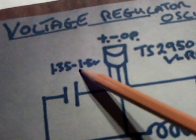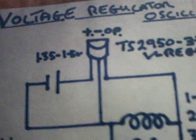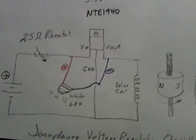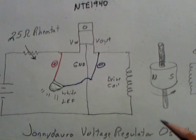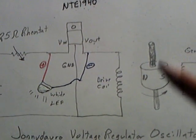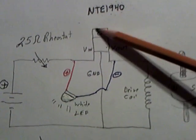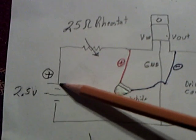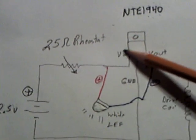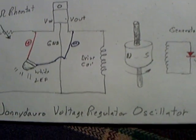I had to run mine with 1.6 to about 2.5 volts. I couldn't get it to run on lower voltage because of the part I have. I rearranged this a bit and I've got this on a little spinner motor — it's our one-magnet, no-bearing motor that I put on a frame with bearings. I have a 25-ohm wire-wound rheostat to vary the voltage and get it into resonance to drive that magnet. It worked like a champ and I was extremely happy with how this worked out.